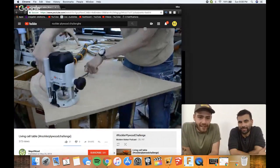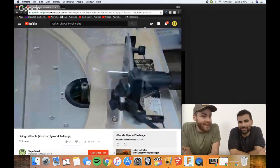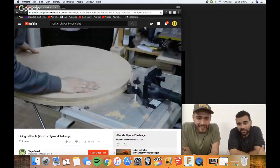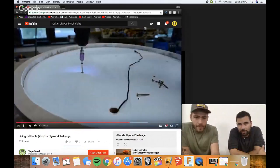I also cut two more plywood pieces to a round shape. One of them gets trimmed flush. I'm going to drop the template for the other one, and use my router to cut an inner circle. After cutting the circle free with the jigsaw upside down and flush trimming it, it gets glued to the other piece to form a pocket. After more flush trimming, they get a round over at the bottom and a sanding before they're secured to the base with two screws.